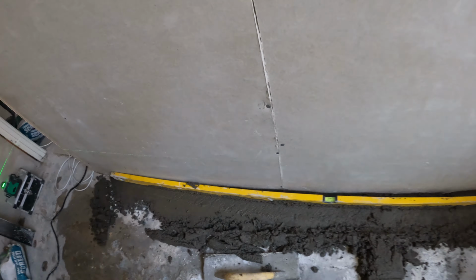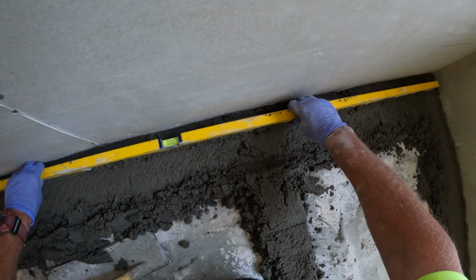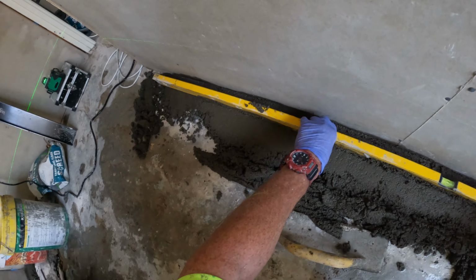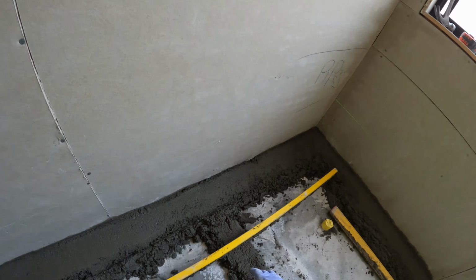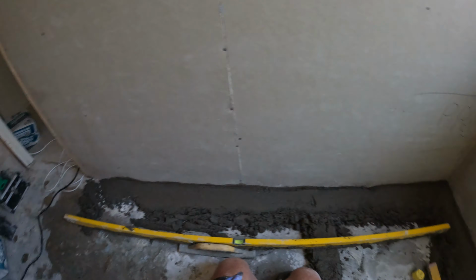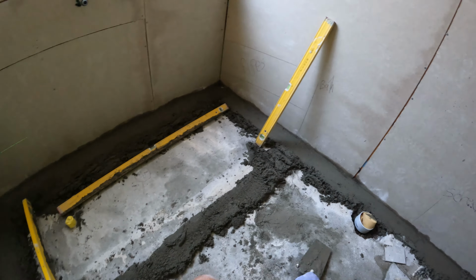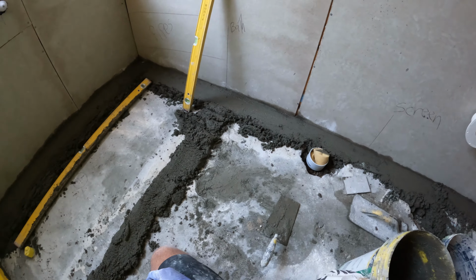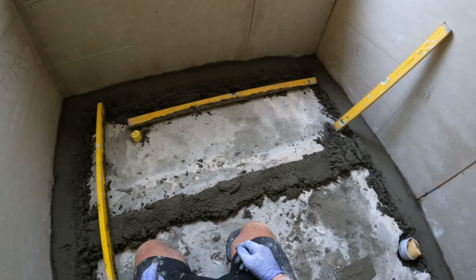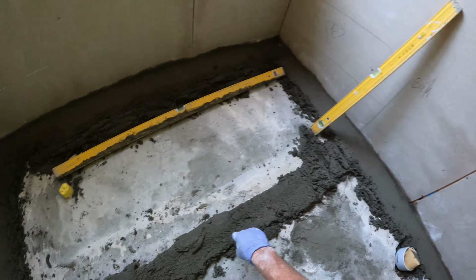If you've used a laser level and it's just slightly out, well, you've got a little hump that's holding your level up if you have laser leveled your pads. So that's bang on. Now what I'm wanting to do is go from here up to there 5 mil. I'll get this right across here because that's the finished height here.